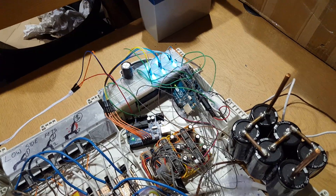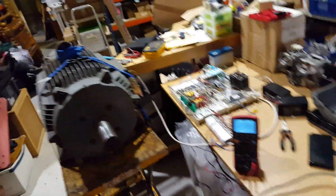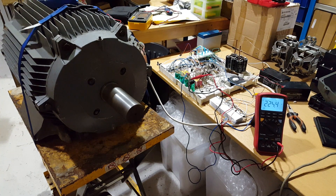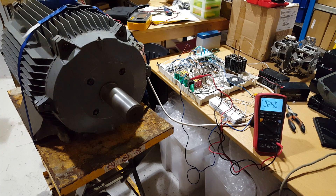So what the controller will do - next week - is measure the speed of the rotor and then output a speed proportional to that, so you can increase or decrease your slip frequency. Can't get over the amount of air that fan kicks off. This is also a really good test of the snubber circuitry, because that's going to be having a lot more inductive spikeback, back EMF coming off of this motor. So I can measure the temperature of all the diodes, capacitors, and the resistors on the RC network and just check that they're not getting too hot or under too much stress.